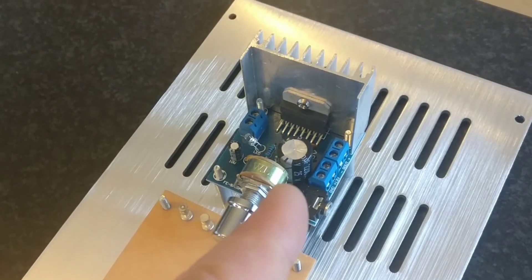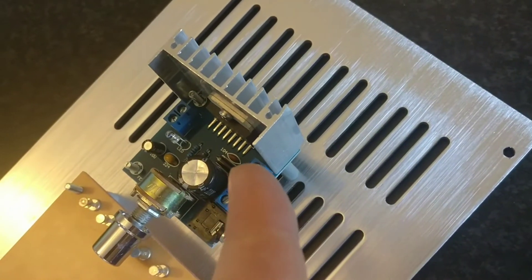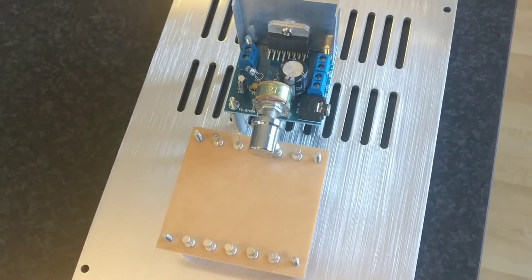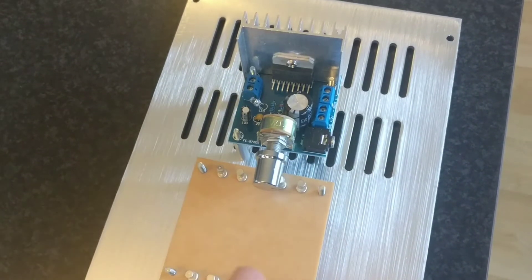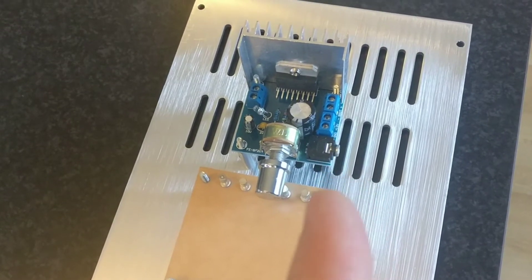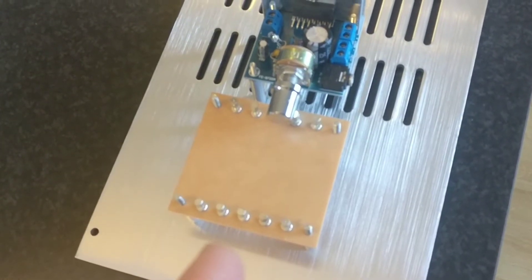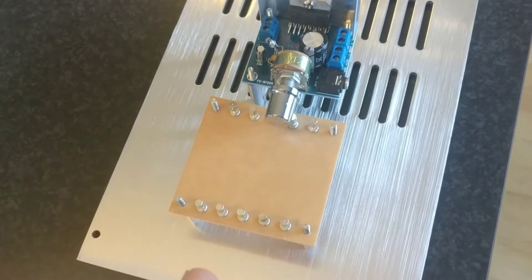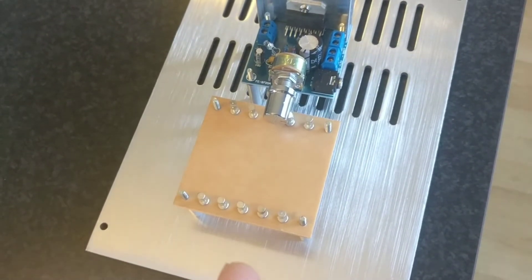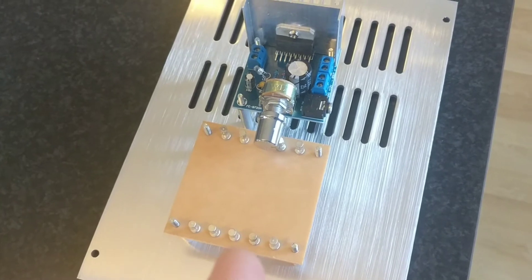This cap here is going to be replaced with one low ESR, bigger capacity unit for the power supply at the same voltages, and the diode is going to be removed also. I'm aiming for highest sound quality, so I'm thinking of hardwiring the speaker cables directly to the amp board. The speaker cables are going to be soft annealed silver wires — no compromises.